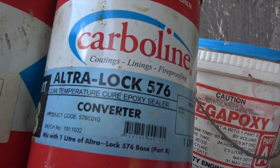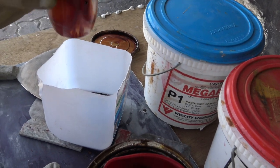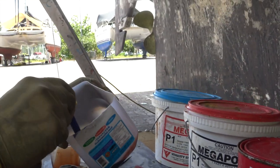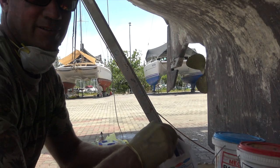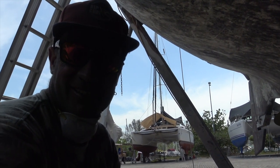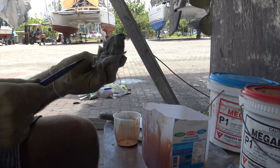It's a two-part epoxy sealer. Equal parts — the clear stuff and brown stuff, 50/50 mix. How long do you mix it for? Mix till your heart's content — probably a couple of minutes — and she's good to roll.